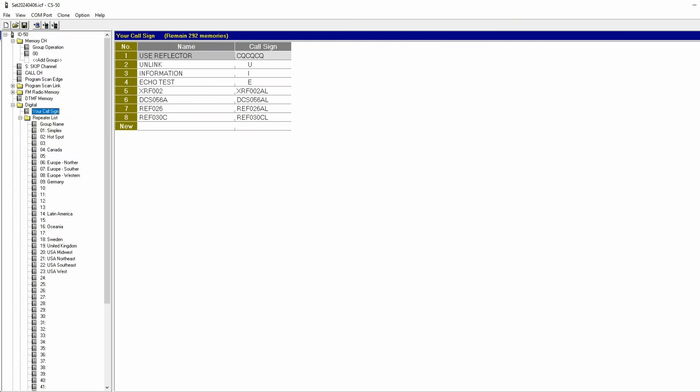I've entered my repeater callsign as part of the D-STAR registration process and entered the gateway callsign with a G in the 8th position. If this sounds like a foreign language, go back to the intro video and focus on the 8-character naming requirements for commands, reflectors, and callsigns. I've also entered the hotspot's latitude, longitude, and UTC offset — that info is required when using the nearest repeater feature. The UR entries allow you to control D-STAR functions using the smaller knob on top. I've got standard D-STAR commands listed to control things like unlinking, getting info, doing echo tests, and a couple of reflectors with an L command, making it easy to unlink and relink to another reflector. Be mindful of repeater owner desires regarding linking and unlinking.